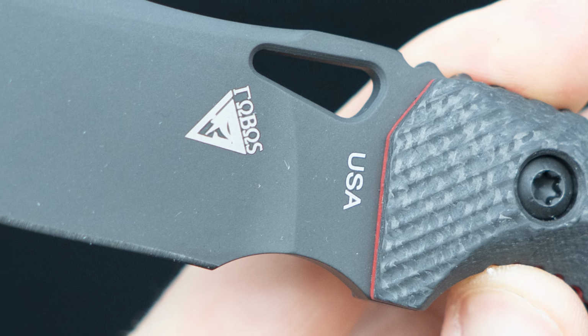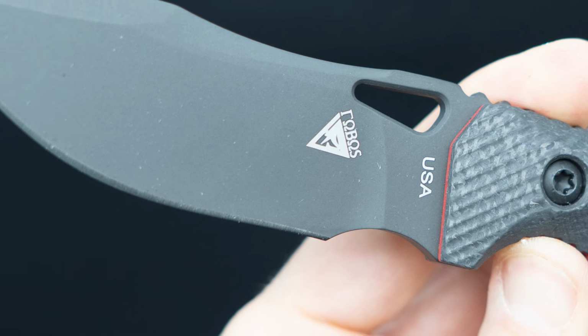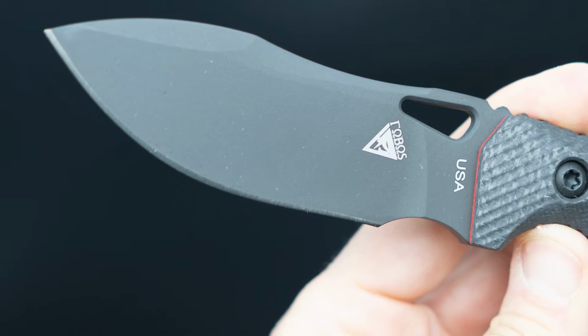On a good fighting blade, I like my weight right down the middle or right where I'm actually going to strike, not so much in the blade itself. Well, you know what I think is part of the strength, not only the heat treat, but you're typically in a two-thirds or higher saber grind, not a full flat grind. To me, the saber grind is the superior grind for most tasks that I need it for. It's the perfect balance between durability, strength, capable of splitting for fire prep and all that good stuff, yet you lose a little bit of the mass, so it keeps it nimble and just a well-balanced blade.